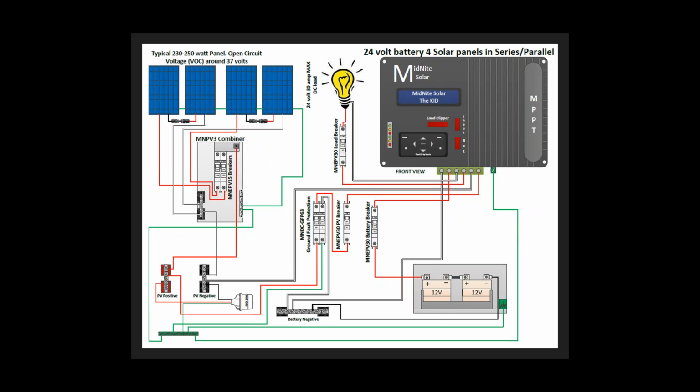Do you guys run into inspections or anything like that? Do you have to have an electrical inspection on these systems at all? No, not that we have been told yet. Okay. Technically, to code, you're supposed to have a ground fault protection breaker in line there. Do you have GFI on any of your systems? No. Not the ones, and that was something we were looking at. We've ordered all of the breakers and the ground fault for the new systems. Okay, good. Yeah, it's a good idea to have it in there. Some of these smaller systems, it may not seem to be as important, and it probably isn't overall. But if you want to be 100% code worthy, then that ground fault protection breaker should be in there. So that's good.